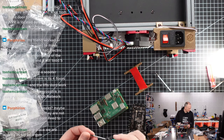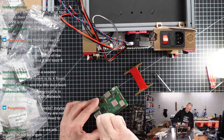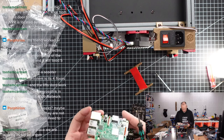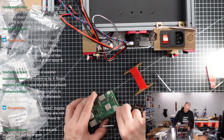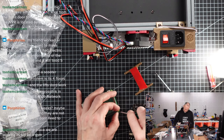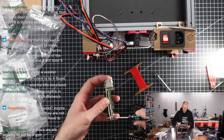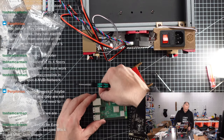Oh, come on, these are fresh, they're not magnetized yet. It's a little unfortunate. Don't want to overdo that because they are not flat head. They're sunken head, so we don't want to push them too hard because that's going to break the PCB otherwise. Just enough that it's touching the PCB, it's holding it, but not too much force. Good. Last one here.